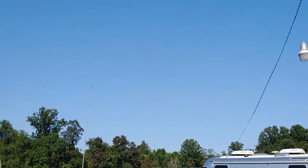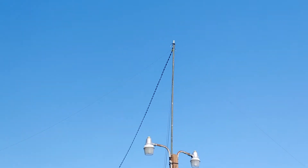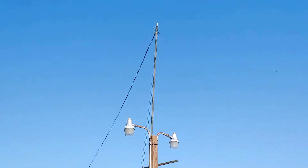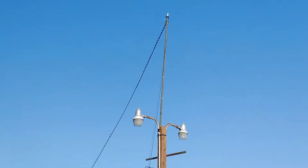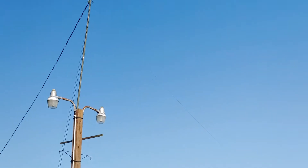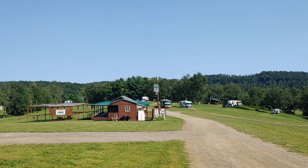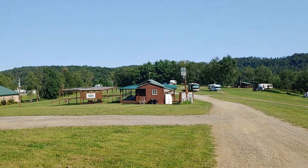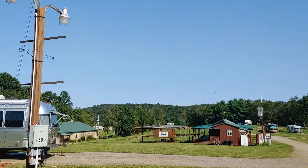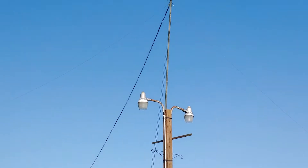There's a vertical pole down here holding up about 25 feet on that end. The center of the antenna is here off some military poles, up above the light pole about 25 feet. The other end is stretched down there where you see those parabolic Wi-Fi's in a little building, and the cable comes up there. So it's in an L shape — not an ideal situation, but it works pretty good.